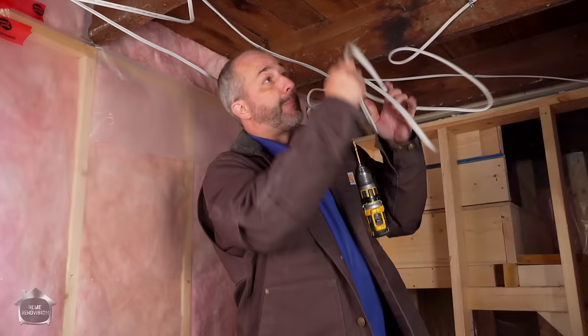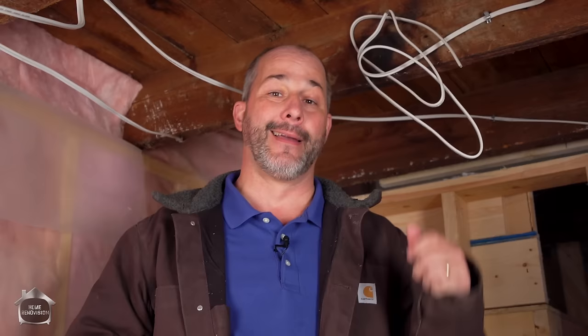This is how you're going to find your best exit. First rule: you need power. You need to get an electrical wire from your box up through the ceiling over to where the fan's going to go. Don't be cheap when you run this — leave lots of length; that'll give you the flexibility to pick a location, which corner of the fan, and all that kind of jazz. Put a screw in the ceiling and hang your wire off that screw, out of your way. If you want to know how to connect all that to the boxes, we actually did the wiring video on how to wire this entire bathroom — we'll put the link in the description below.